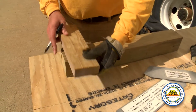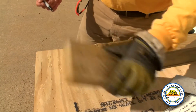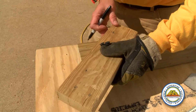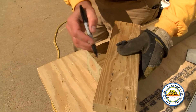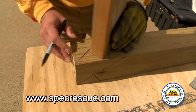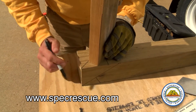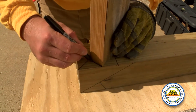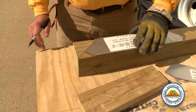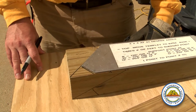We'll start with a 45. Just get to a flush end of the 4x4, place the 2x4 across, draw your line down — that gives you a 3.5x3.5 square. Now you just connect this end to the corner of the 4x4, draw a line straight across — that gives you your 45 degree angle. Now if you come up and make the line you have just drawn and the edge of the wood match, that will give you the notch to cut so it'll sit flush. That gives you the edge of your raker for a 45 degree raker.